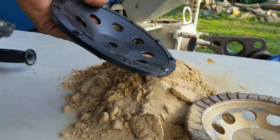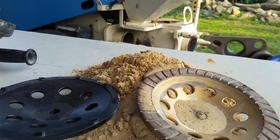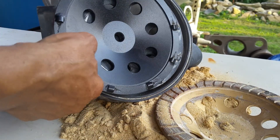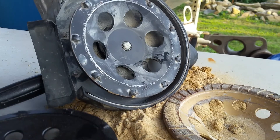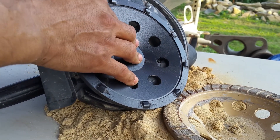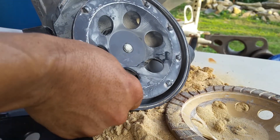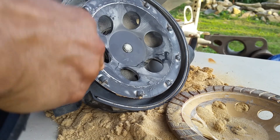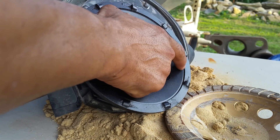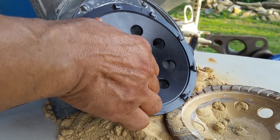Here are a couple of cup wheels to show and tell. This cup wheel and this cup wheel will seem similar but they're not - they have different venting for cooling and getting rid of dust. This cup wheel is not as well machined as the one on here. This one is machined better, it's got a larger lip. This one has a thinner lip, almost like it was fused on. This is steel, this is more of a cast material.